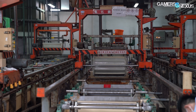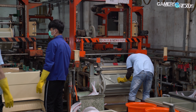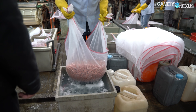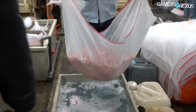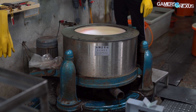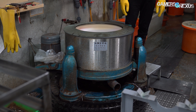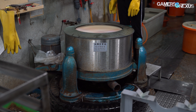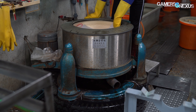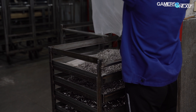This factory plates with multiple different metals, sometimes including gold for gold-plated objects. At the end of the line, the barrels are opened up and dumped out into a tub of running water lined with a net. Workers then manually gather up the net and dunk it in a series of acidic chemicals and water to clean and rinse the parts, then place the bundle in a centripetal dryer, mount it to a truck tire, and spin it for a few seconds to get the excess fluid out. Bits Power uses the same type of dryer, and despite looking jury-rigged, it's actually a standard solution — the large truck tire helps absorb the violent force.